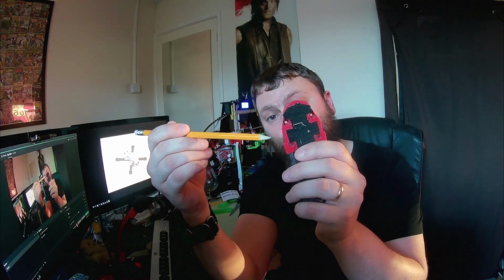But the difference is, the reason I had to make the arms longer is the props I would find were too close to the body, and the LiPo hangs over just slightly. So if you have a crash and you move that LiPo left or right just a little bit, it's in the direct line of fire from the prop and it will damage it.